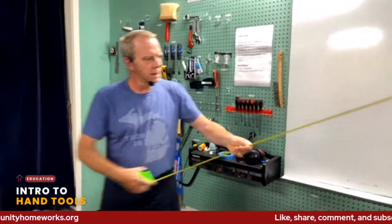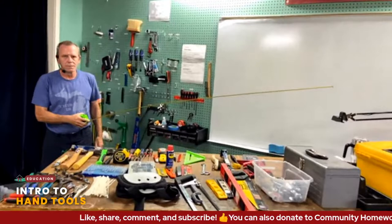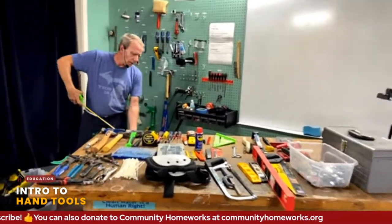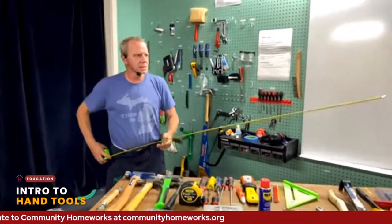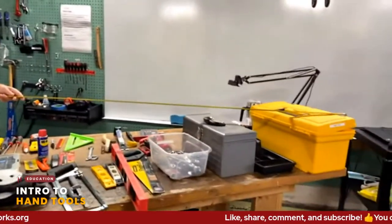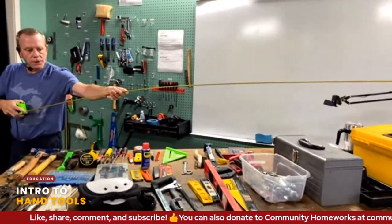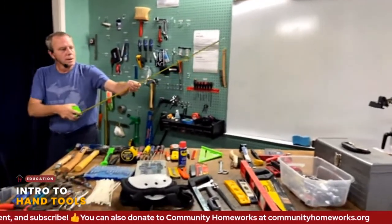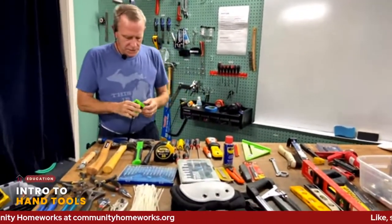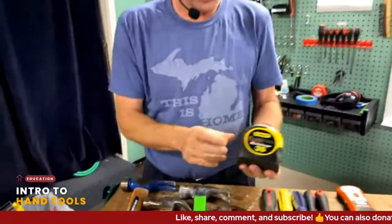One of the things, if you want to do a test on a tape measure, I say at least 6 foot. You should be able to extend it out 6 foot without it breaking like that. The reason for that is it's a safety thing. If I'm standing on a ladder or something like that and I need to extend this thing out to hook it on by myself or for whatever reason, I can extend that out and get pretty far actually. So that is one of those things. The other thing with tape measures is sometimes you don't necessarily need this. This is my personal one, this is a 35 footer.